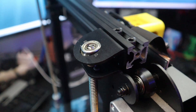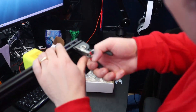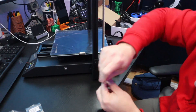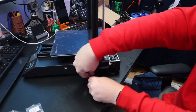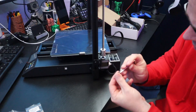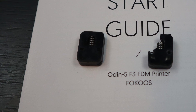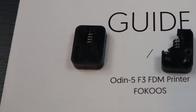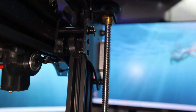I took a plier during assembly and bent it back a little bit — the screw is kind of loose like on the other side, like my other Odin 5, so I wasn't too worried. I assembled the gantry onto the base to keep it square. On the back left side where the bracket was bent, I also noticed something missing: Focus uses a little holder with a spring and an axle for the inner V-slot wheel, and that one was broken — the wheel wasn't sitting inside the V-slot of the extrusion.